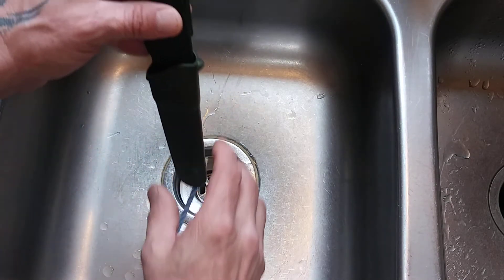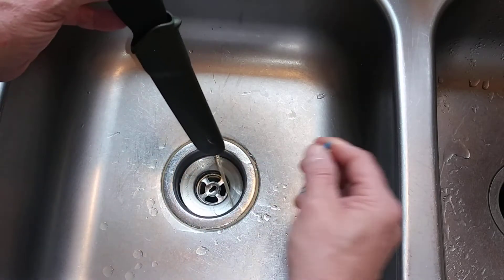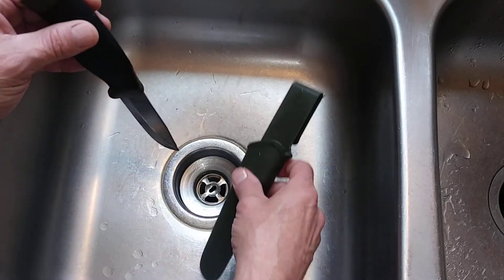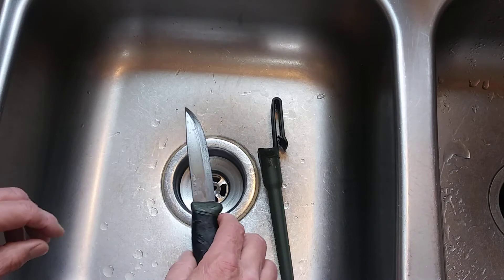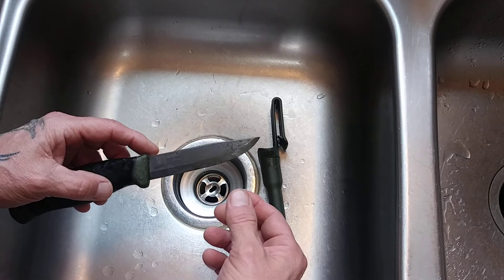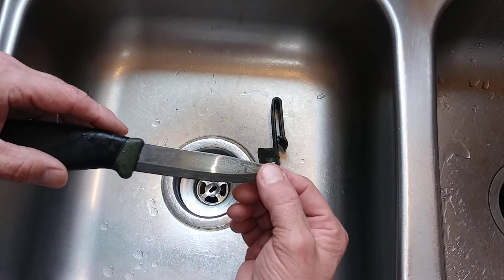Okay, it's been 15 minutes. The longer you keep it in the vinegar, the darker your steel will turn. Now this doesn't really work with stainless steels — this is the carbon steel it works good with. It's probably a tool steel like D2.